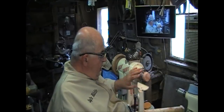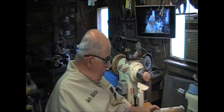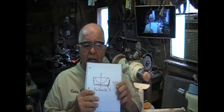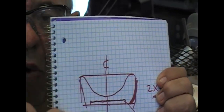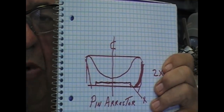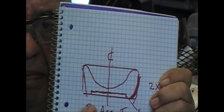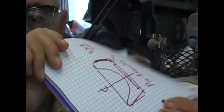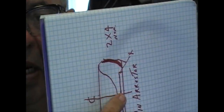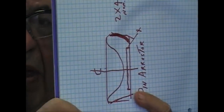I faced it off nice and smooth. I'm going to knock the corners off this and then stick it on there to start the work. Before we get too deep into it — because I always tell you to do this — I did it. I drew it on a piece of graph paper. That is my two-by-four in profile. Now, what I'm going to create is: the first step is this little recess in the bottom to put a rare-earth magnet, which I got at the hardware store. Then we're going to turn it over, stick it on the lathe with the headstock being over here, with double-stick tape. And then we're going to put this recess in it, and all that's going to be based upon this drawing.